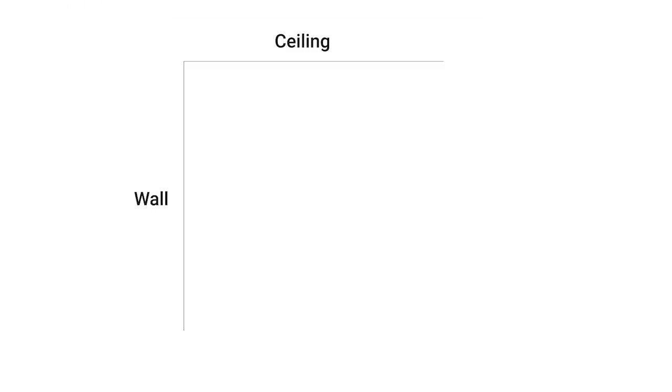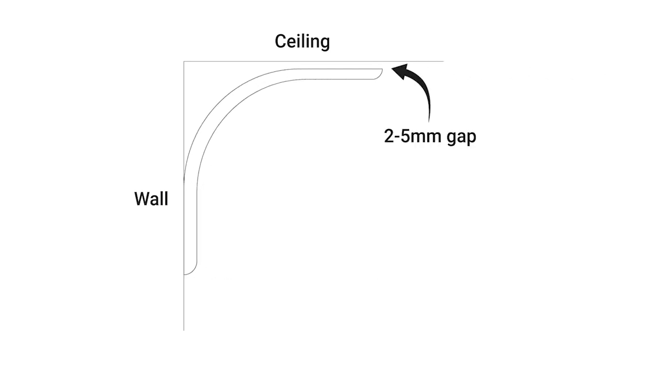The bronze system is 60 millimeters wide — remove the coving behind this mark. Some coving will come away cleanly and can be reinstated after the installation, but remember it's better not to reinstall any coving for the best soundproofing. When it's replaced, only adhere the coving to the wall and leave a two to five millimeter gap from the ceiling so they aren't in direct contact. You'll see that this is a theme throughout wall soundproofing installation.